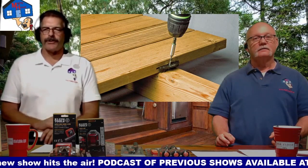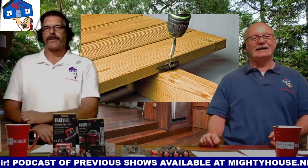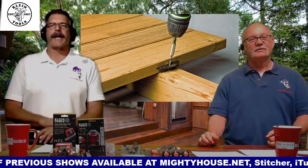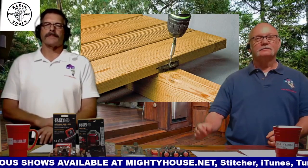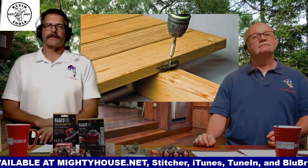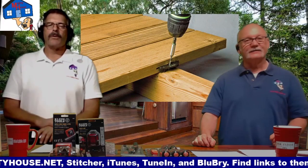Normally when you build a deck you might leave your decking overhanging an inch and a half to two inches. I would actually let it overhang two and a half inches, because you can always come back the next year and straighten the edge after it's dried and settled. If you're doing a job for somebody and want to get paid, you can't say you'll be back in a year to trim that edge — so give a little extra where it can be trimmed.